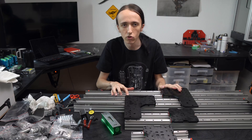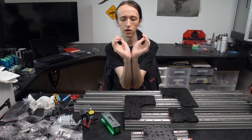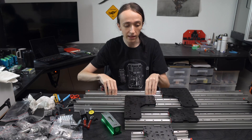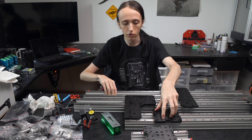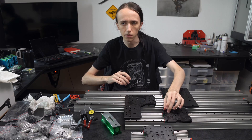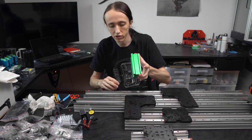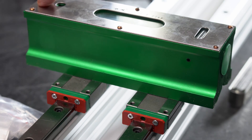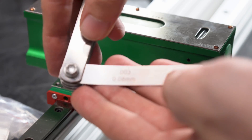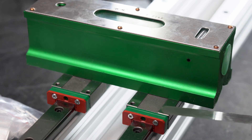What they put as a side remark in the manual is that while these extrusions are fairly straight lengthwise, they do have slight twists and the C-channel also opens a bit. This is to be expected due to the way these things are manufactured. What that meant was that on the first axis I did — the X-axis — I screwed everything down and the bearings basically locked up completely. You could not really move it anymore at all. But if you loosen the bolts, it moves perfectly freely. I busted out a level as my best straight edge, put it on top, used some feeler gauges, and found out that the outsides of the bearing blocks compared to the insides were out by about 0.08 mm — 80 microns — which is quite a significant amount when you're pulling a precision bearing that far out of alignment, which is why it locked up.